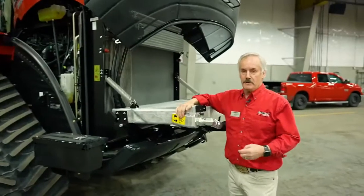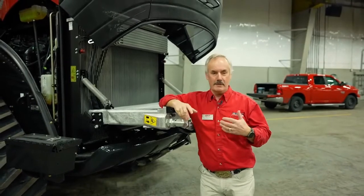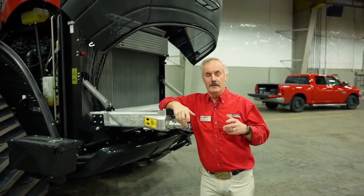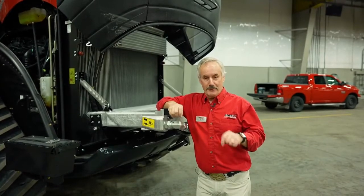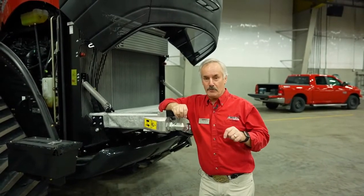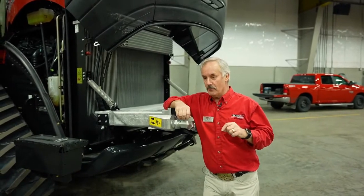All right, now you're going to ask yourself questions like, why is this so important? I have to drain the antifreeze. Okay, so we tell you that 2,400 hours is when you drain the antifreeze. It doesn't hurt anything to drain it prior to that, but we're good to go to 2,400 hours.